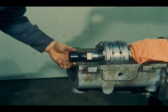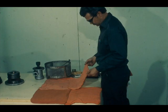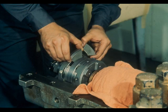Once the oil pump bracket is removed, the oil pump coupling components are exposed and may be removed at this time. We will not go into detailed explanation of the oil pump or its coupling, since there are numerous arrangements employed by equipment manufacturers in their lubricating oil supply systems. Before starting the disassembly of the thrust bearing, prepare an area to place the parts as they are removed from the housing. Clean cloth spread out like this will provide an excellent area for this purpose. Now we are ready to disassemble the thrust bearing. We will begin by removing the thrust shoes on the outboard side of the thrust collar.